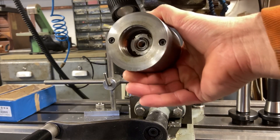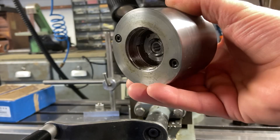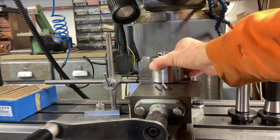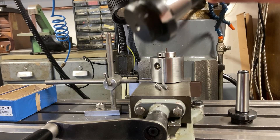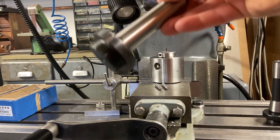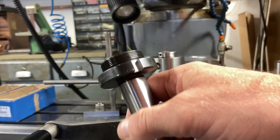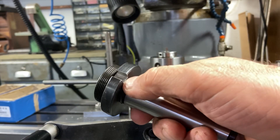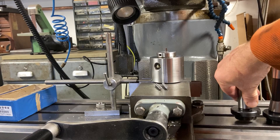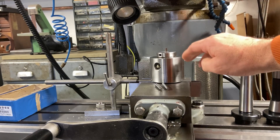I've made a tool I can use both on the lathe and the milling machine. I've produced a thread in the back to take two arbors — the R8 and the three morse taper — and they literally just screw into the back. I've machined a groove in each so I can put a C-spanner in there to assist getting it removed.